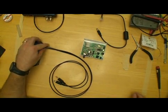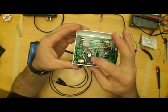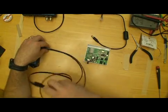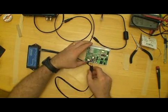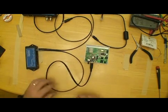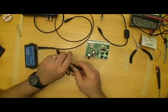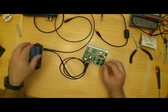In this step of the DIY, what we're going to do is we're going to calibrate the little potentiometer for the output signal. And to do that, we have to hook everything up, which means we have to have a program in the aqua controller. We just have to have the pump in there so that we can tell the aqua surf to turn the voltage on to that signal. So in order to do that, we've got to hook everything up.